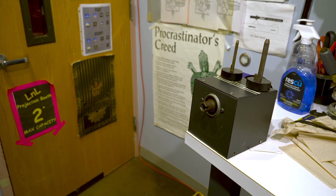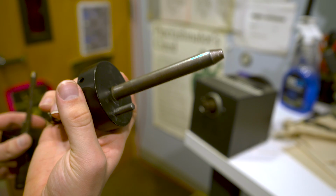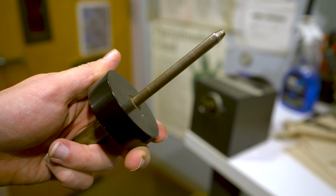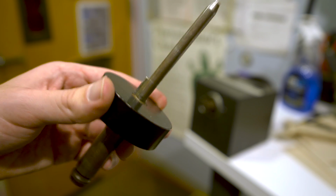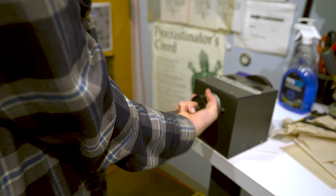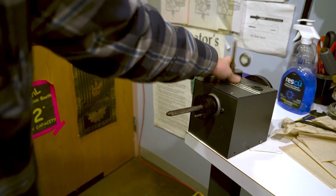The first thing required is setting up the film bench properly. In this case, we have 2 spindle sizes. We have a larger spindle size, which is designed for our projection 40-minute reels, and we have a smaller spindle designed for the shipping reels, 35mm 20-minute reels. So we just take the one we want and we stick it in. You wait for the click. Now it's in. We chose the larger one for the 40-minute 35mm reel, and we place back the one we're not using.